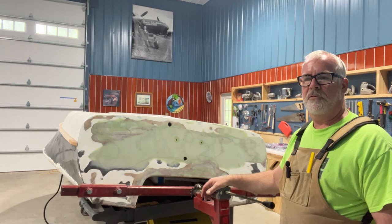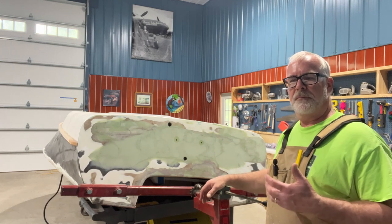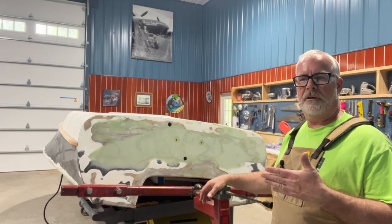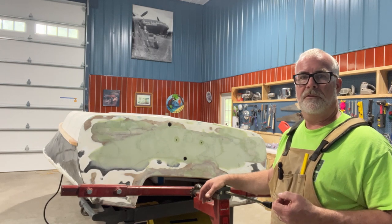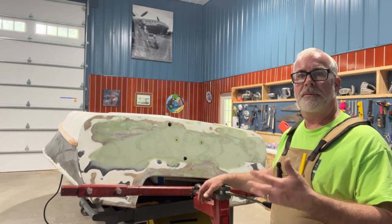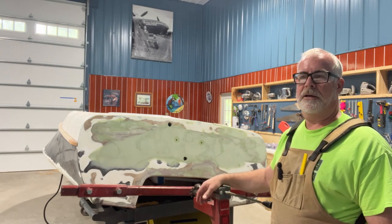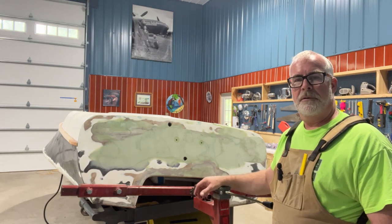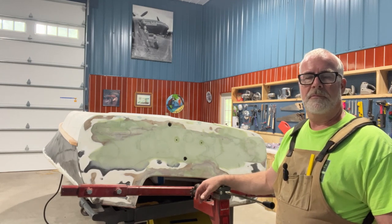But in the last 20 years, I've got print through. Print through is something you really see with fiberglass cloth, especially with older boats. You'll notice that the paint is either thinning or worn off, and you'll see the more durable product on the boat is the cloth, which is the fiberglass, and it has lasted and it's now appearing on the surface of the boat, and I can see it just from looking at the black at a certain angle.